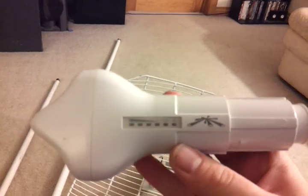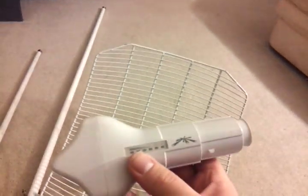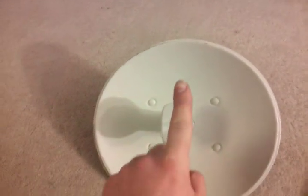Same thing with the air grid — it's a grid design, one of the larger ones, with two mounting brackets and holes on the bottom for the CAT5 feed-through. This is just the 2.4 GHz head with power, LAN, and the four LEDs. The air grid is a single polarity antenna — either vertical or horizontal depending on how you've set it up. Setting up in this mode is vertical mode. The nano bridge is dual polarity, with both vertical and horizontal antennas built inside.